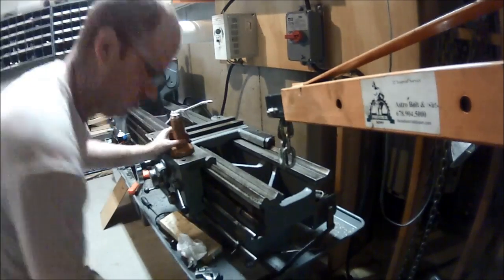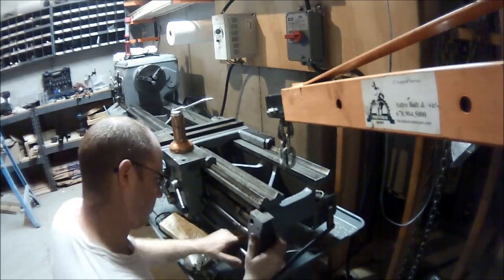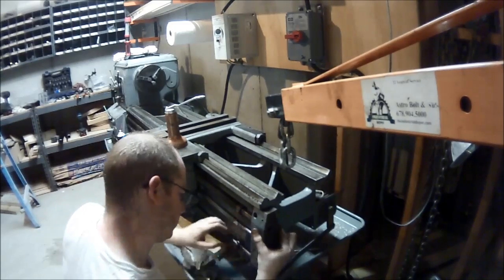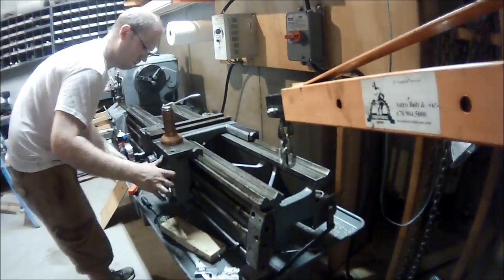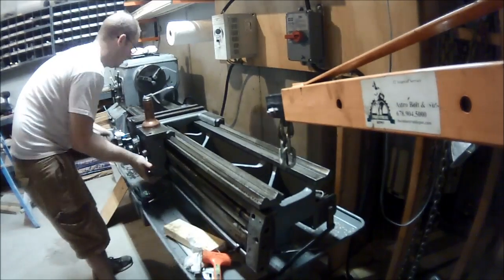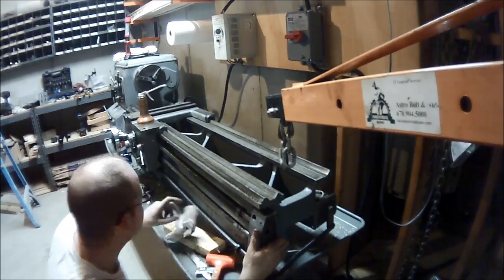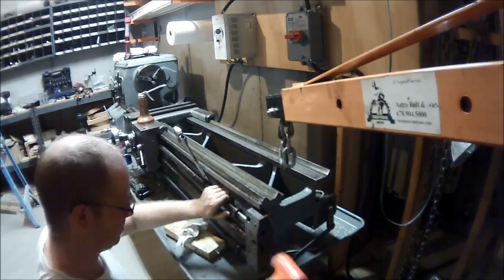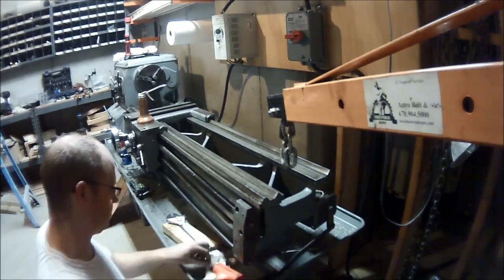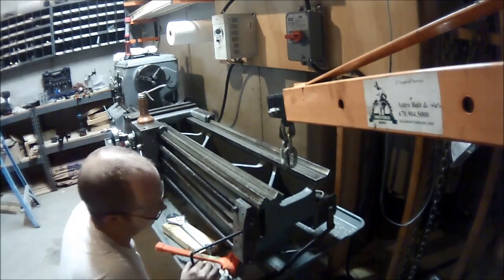Then from there I added this collar. There is a forward/reverse/neutral lever on the front of the lathe and that is keyed — there's a slight pin on the bearing block — so I just wanted to make sure that piece was on. I did not put the keyway in first. Line up the bearing again, move the entire assembly over — makes it easier. This orange hammer — I swear you'd think I was a two-year-old playing with a hammer, I had such a good time using it. There was a slight problem — it's not sliding in. It turns out to just be a slight amount of dirt. I then use a wrench to try and pull the pieces out because obviously there's a pin that it's going to have to locate on. Eureka — we have it. Then I'll line up and use the cap screws to pull that part into place.